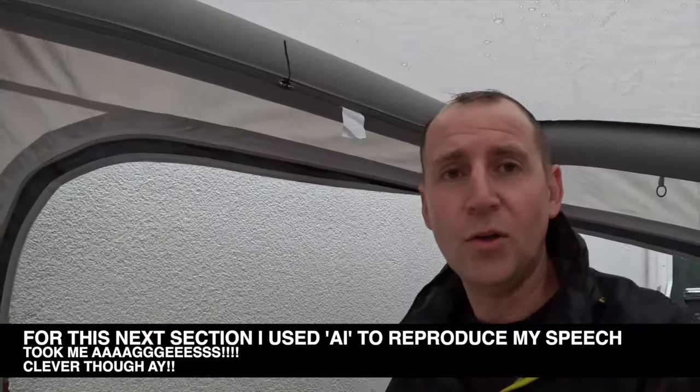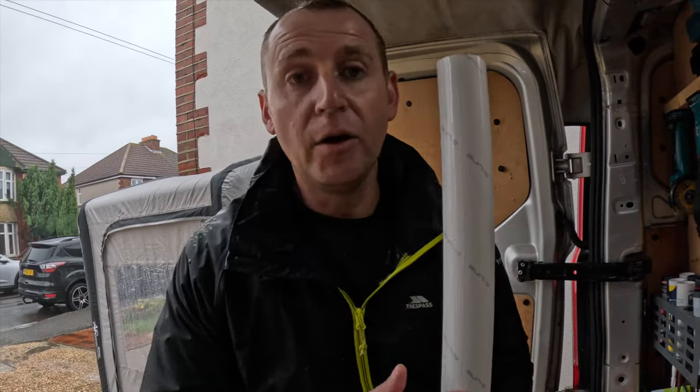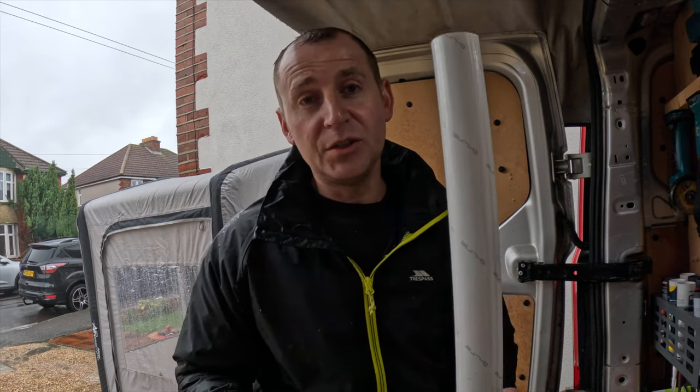There's not a lot of room in here. The other thing with this Dry Cab is there's room for me, but if you've got a bundle of tools like I have, you're not going to get them in here. I'm so concerned about this blowing away. What I'm going to do is mount the charger here, and then I need to hide that black EV Ultra cable coming up the wall. So what I'm going to use is D-line oval trunking. I know a lot of you are going to comment saying you don't want trunking on the outside of walls — but D-line has specifically produced this for this exact reason. It's UV rated, you fix it to the wall, and it's going to hide that cable. It's been designed for this purpose, and I've had a good chat with my client and he absolutely did not want to see the black cable. This is the best way to do it as far as I'm concerned.